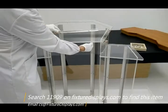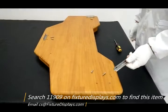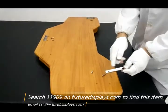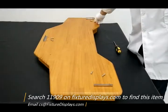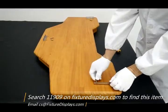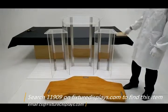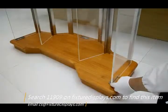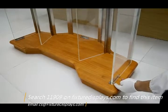The bevel stop or book stop is installed from the bottom — the screw goes through the bottom up to the strip. There are three base brackets. The holes are pre-installed with nuts, so you don't have to look for nuts for those parts. Fasten the bracket to the base with the opening facing inward.